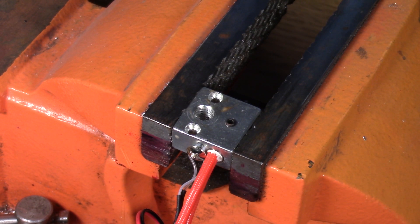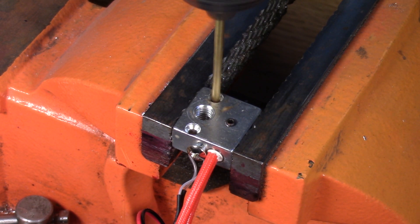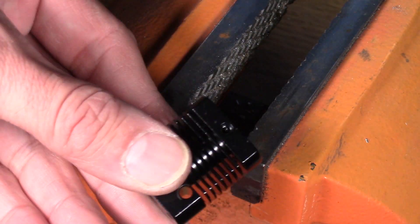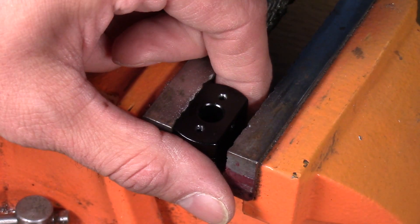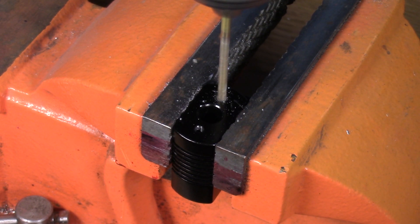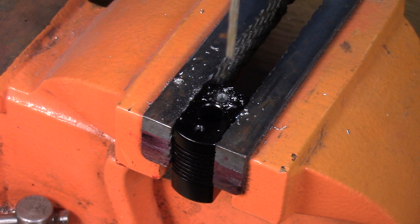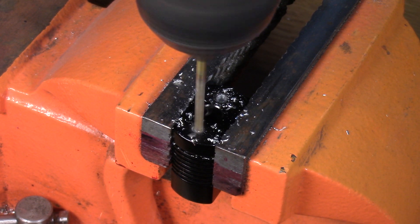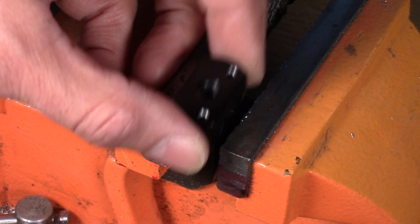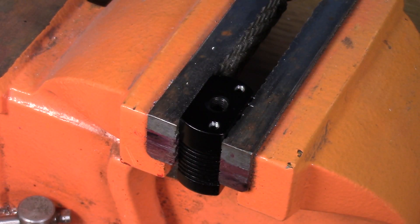Using the 7/64 drill bit, drill the two holes until they are slightly bigger than the bit with a good rounding. Sand the sides lightly if needed, unclamp, and put aside. Set the heat sink into the vice clamp with the single grub screw hole facing upwards — these two holes will be connecting the heat block. Using the 7/64 drill bit, drill the two holes until you feel you are through. Sand lightly if needed, unclamp and flip upside down, and reclamp. With the heat sink now upside down, the grub screw hole should be facing down.